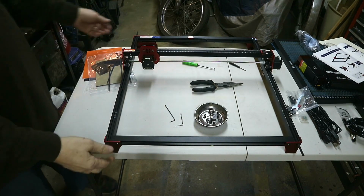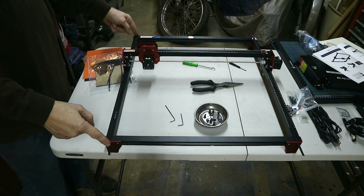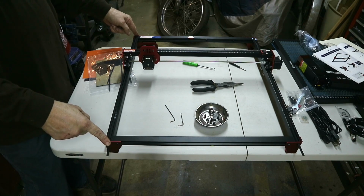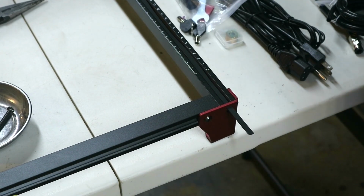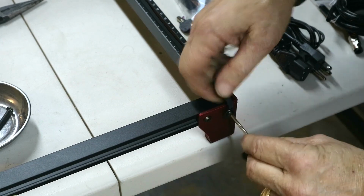Now what they want me to do is pin the belt down using 4 screws and washers. And you're going to have to set the belt tension at this time as well. Oh, I left this last one here to show you how I'm going to do it. And they say I'm a noob at laser engravers, but I have set up a bunch of 3D printers, and they use the same type of toothed belt.